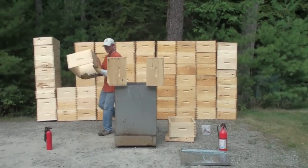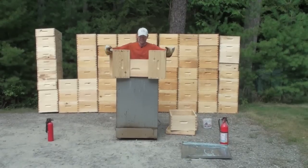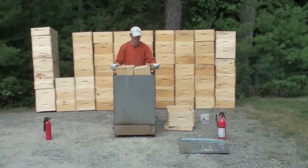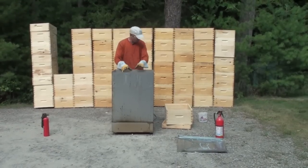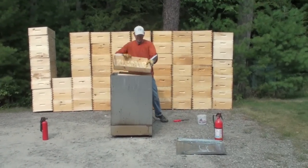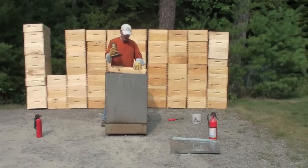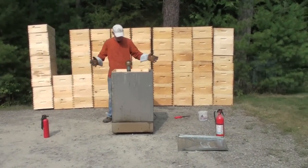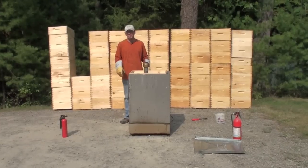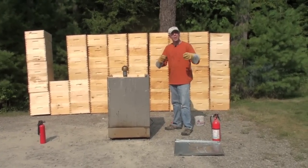Be really careful not to splash — this is the dangerous part. Just lower them in nice and easy. They're going to want to float, so I put an extra piece on top, then a lid on top of that, and a big heavy piece of metal to hold the whole thing down. We're going to time it — give it about 10 minutes. You probably don't need more than 15, and it'll start to darken your wood at 15 minutes. 10 is just fine and you'll get plenty of penetration.